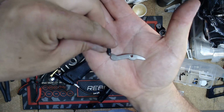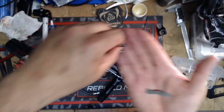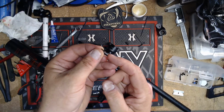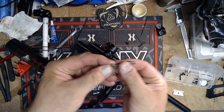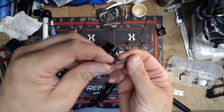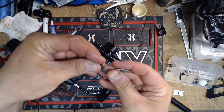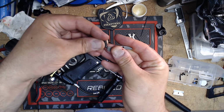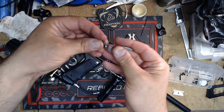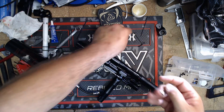Okay, so with a taper like this, there's more surface area contact. When it's at 90 like this, there's less surface area. It's just connecting on this little edge here. The 90s, if they're hardened, and this isn't hardened, you can see it start to wear on the back of this. The tapers, if everything's polished nice, you have a better chance of, I don't know. There's all these theories. To me, there's greater friction here, to a certain degree.